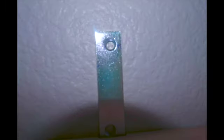After the seal has dried, you're then going to screw the L bracket to the bottom of the shelf and make sure your screws are long enough to go through the L bracket and halfway through the shelf but not penetrate through the top of the shelf. I lined up my shelf with the top of the painter's tape. I wanted to find where I needed to pre-drill because I didn't have a stud available.